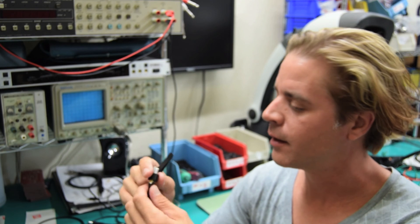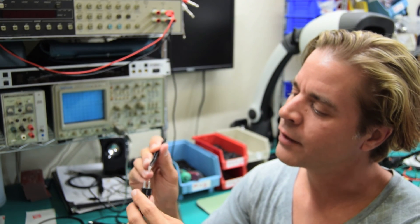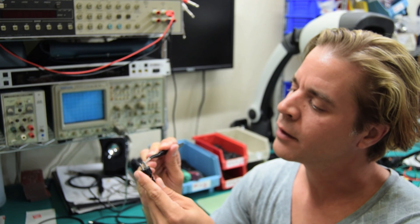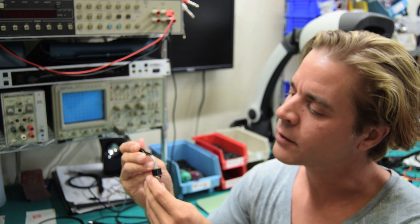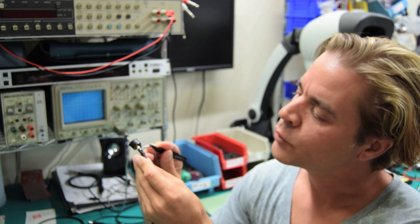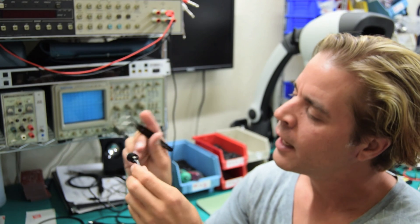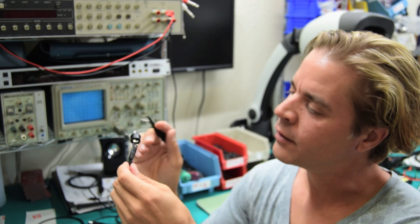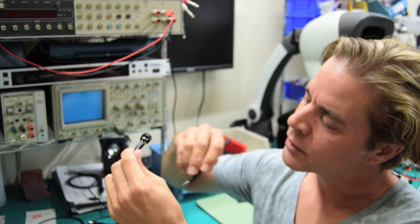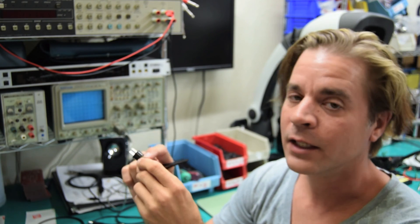Take your Cinch Jones connector apart — you've only got two connectors: one small blade and one large blade. The large blade is the ground contact; the small blade is your signal. You need to include a transistor and a 10k resistor into this little jack. That is what inverts the polarity of our V-trigger, so when it goes high, the S-trigger signal is pulled low, which activates the envelopes in the Moog synthesizer.